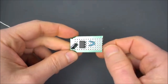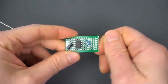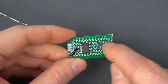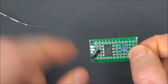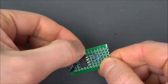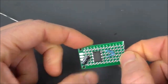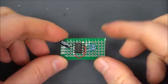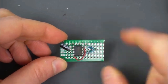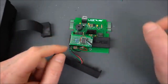I had some of this prototype board, and I didn't have a neat saw, so I just snapped half of the board. I did this arrangement thinking about how the resistors need to be and where things are connected. The output would be right there. And then I'll hook up ground there and the activation signal there. Okay, so there's the final result. I had to add this little cable to connect reset to VCC. Let's actually test this. I've already soldered the wires in place.